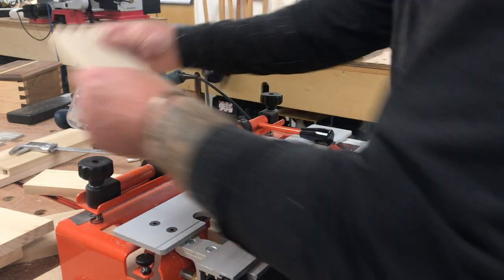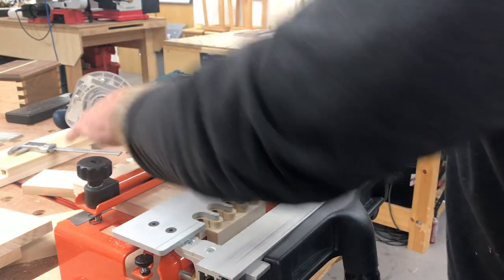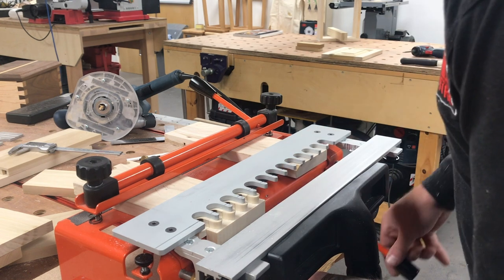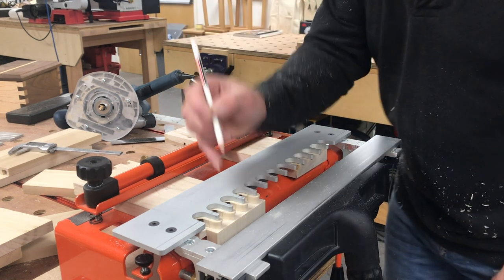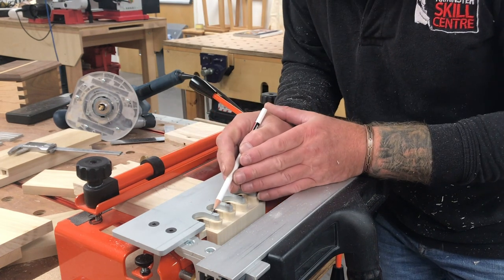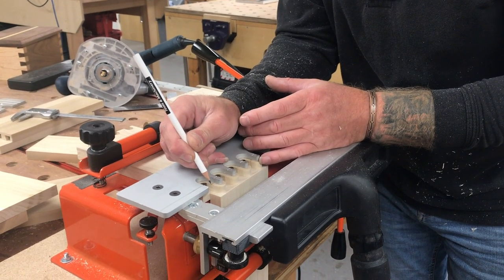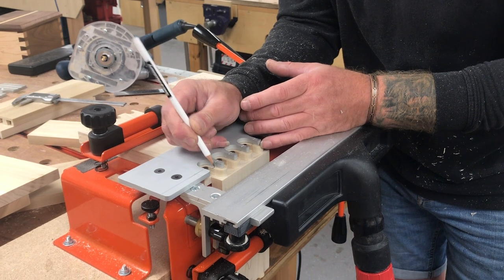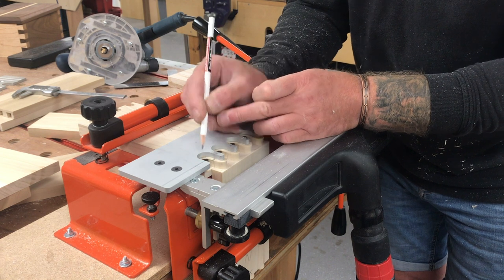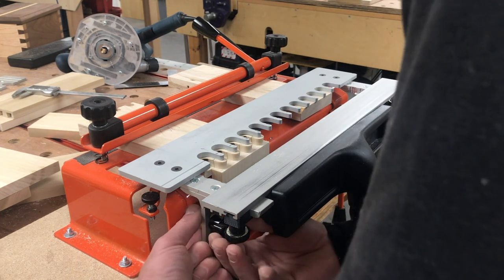And this is where you can remachine, because we're not adjusting height, just adjusting. Okay, there's a little line on the top here. Now that gives you a guideline. You really want to start with that line in line for where those two boards meet. All right, to allow the cutter to come into this board a bit more, I just need to move this template backwards. And that is, again, easily done.